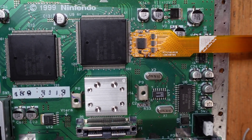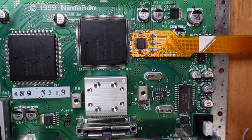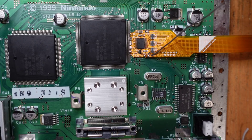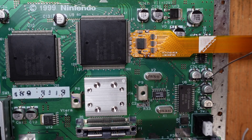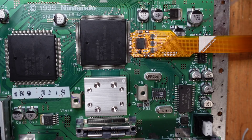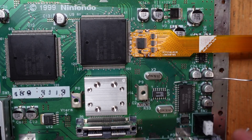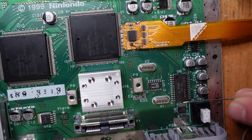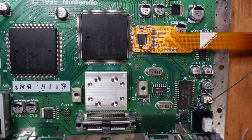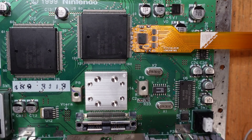We're actually almost done with the soldering on the flex cables. We've got to solder 3 wires to the RCP flex. One is going to connect this side of this cap to this pad here, which powers the flex with 3.3 volts. The second one is the reset line, which goes from this pad over here to the second leg of the PIF chip. And then the final one is the control line, which goes from here to — on this particular revision of the motherboard — a little via over here. Depending on the revision you have the location is different. I'm going to send a link in the description for the install documents, which have pictures of every type of Nintendo 64 and exactly where to solder for the controller line.